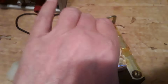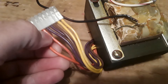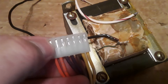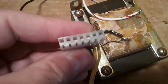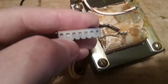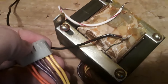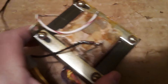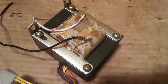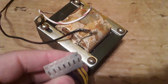This transformer — like I say I still have hope. If I put my digital meter on here and stick them in here, I'm not sure if there's a layer of plastic over there. With my funky eyes it's hard to tell. I was also having problems with my digital meter on a TV I'm working on — checking the line cord, it says open, then I hooked the cord up and it works. Took the back off again and checked the line cord — says open again.